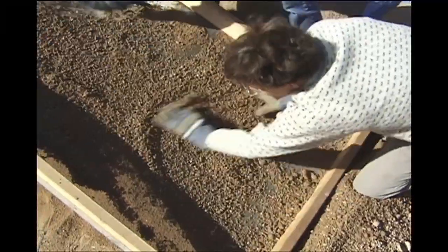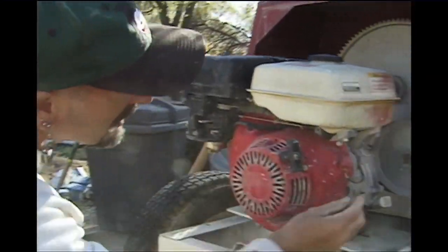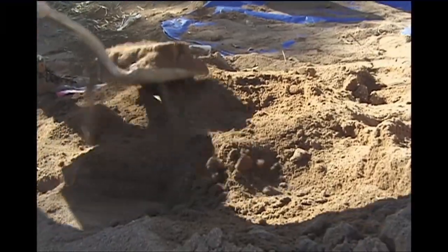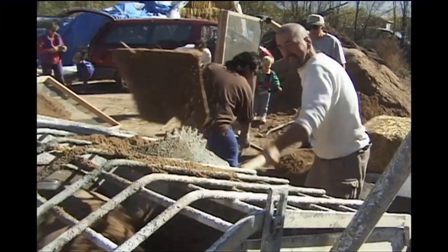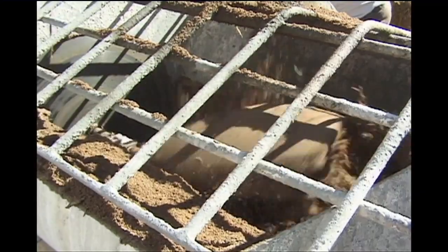The mud is basically composed of sand, clay, and chopped straw. A proper mud mix that does not crack, come off sandy, or deteriorate is basically 70% sand — pure sand — and 30% pure clay. That combination has a stable integrity of not decaying, breaking, splitting, or coming off the wall.